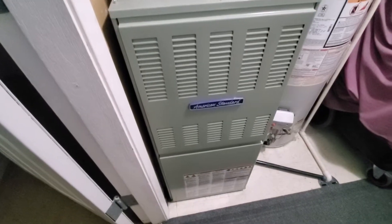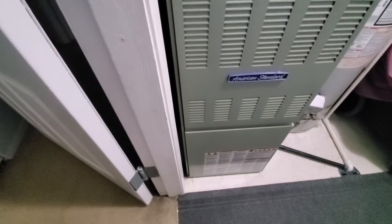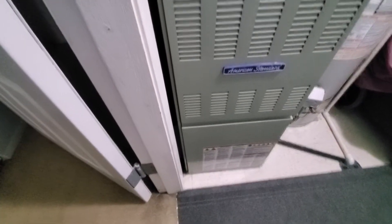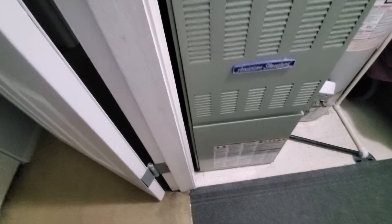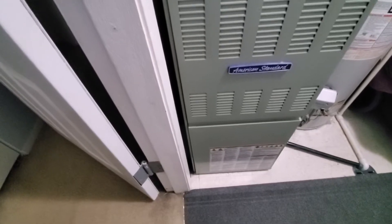We are going to be going with a CVA 70 112, and that's going to be 14 and a half inches wide, which is great. Right now the furnace filter is inside the cabinet, and on the new furnace that won't work well.